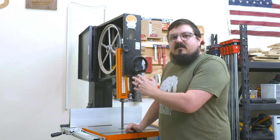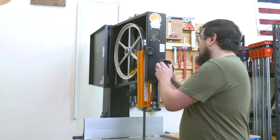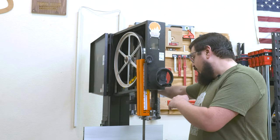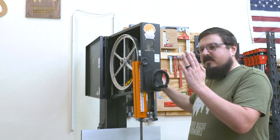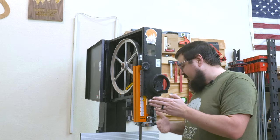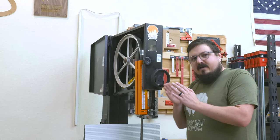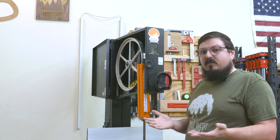Once you have the blade aligned in the center, you don't have to worry about the bottom wheel — the top wheel is the one we're concerned with. Once you have it centered, go ahead and lock that back in place with your side lock. This will allow the blade to ride in the middle of the cut instead of being curved one way or the other. Otherwise you're going to start causing fishtailing and wedging against the fence, and you want that cut to be straight.